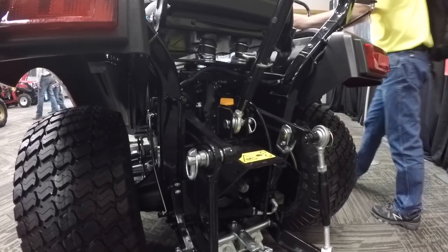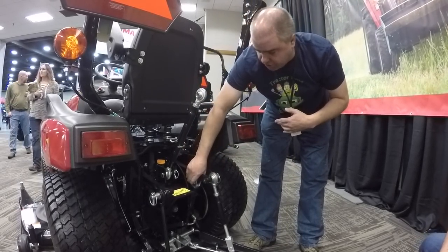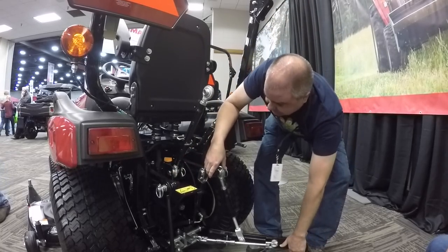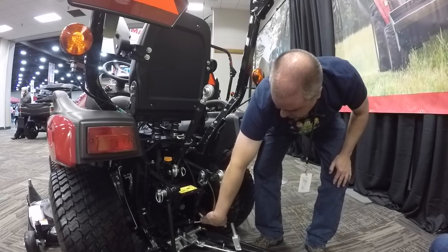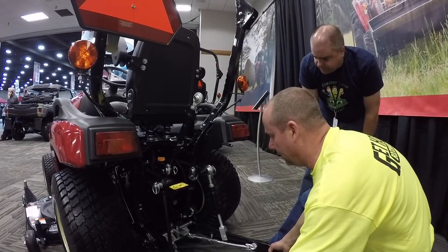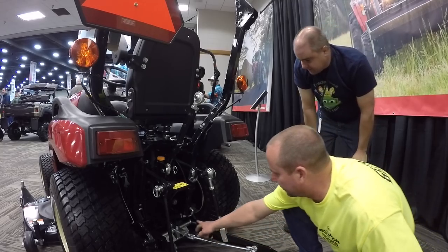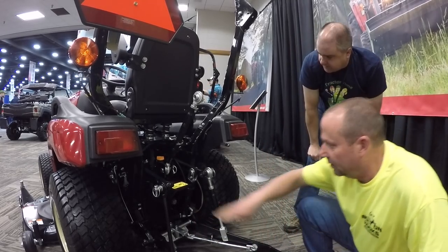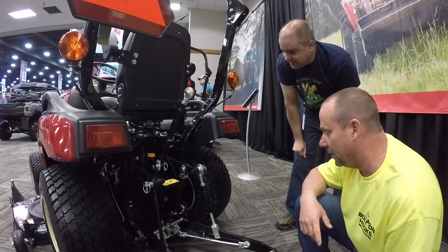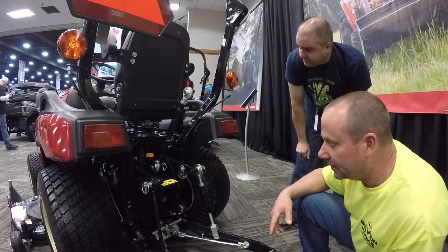See this cylinder here? The three-point hitch here is actually controlled by an external cylinder - I've never seen that on one of these little tractors. Usually the whole rock shaft control is internal, but this one cylinder controls it and then it goes through this shaft to the other side. It kind of leaves a lot of exposed hoses down here, and that's a little bit of a scary place to me. It could be especially if this were forced up. That's interesting. From Yanmar - it's quite a different design than the one series, even though they had a lot of influence on the one series.